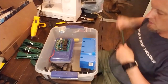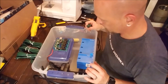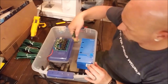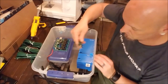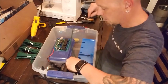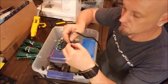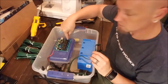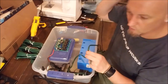Now, we need a line. This relay going right to left with box plug right to left, so I know this is going to be 1, 2, 3, 4, just like the program buttons are 1, 2, 3, 4. So I think I'll start over here and plug that in. Now I need to split the jacket apart. One side of this is going to go into the relay and back out, and then the whole thing is going to go into plug number one, and then we'll wire up the plug.